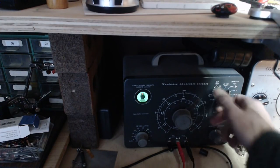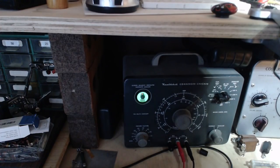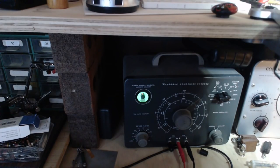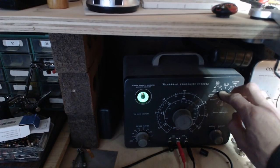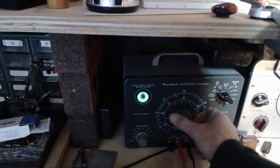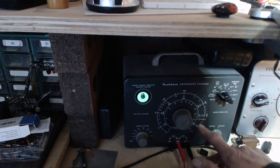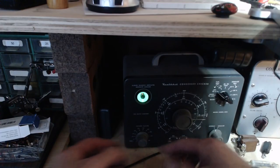Okay, leakage test. Put it on 25. Better than the last one. I'll give it a moment. When I let go of this control, it puts a short across here that bleeds off any charge on the capacitor. Just got to give it a little bit. You got to give it more time than you would imagine. Okay, let's test this guy. 0.02. So it's going to be in this range somewhere. Again, I can see an effect on the eye, but it's not opening at all. And it's reading around the 0.1. When these things are leaky, I think this tester tends to read them high.